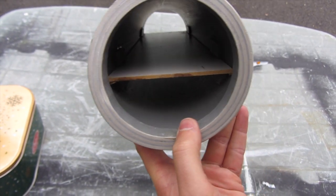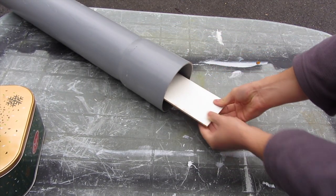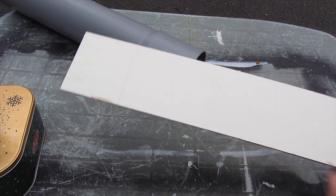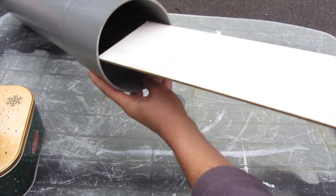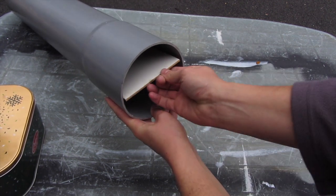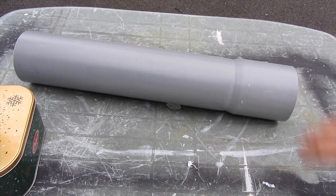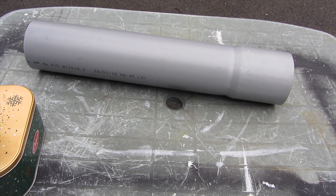So this is going to be the front. It's going to be shut, completely shut, and this is the back, and I'm going to access this to slide in this plank on which I will have everything, the syringe, not quite glued, fixed on it, all the electronics on it, the batteries fixed on it, and I'll simply slide everything in. There will only be obviously the 2 brushless engines for thrust. They will be on the fuselage, left and right on the fuselage. I'll have to connect those with plugs, but all the electronics goes inside via the hatch at the rear.